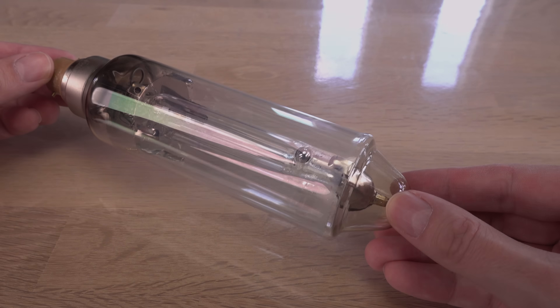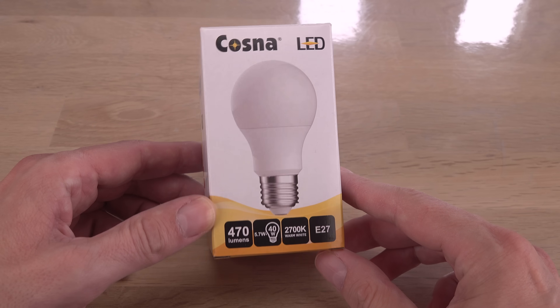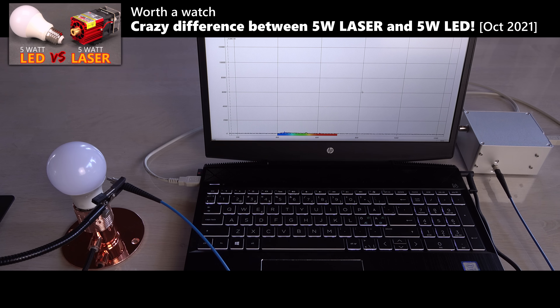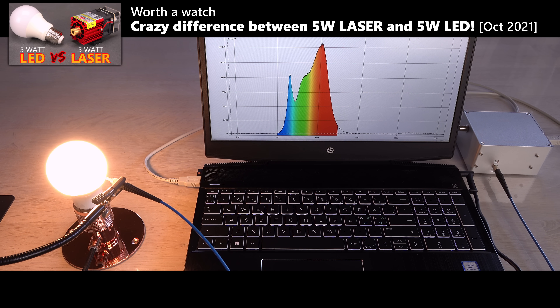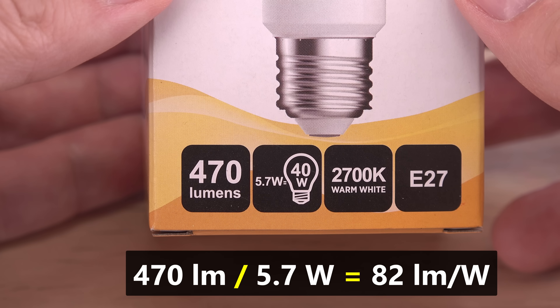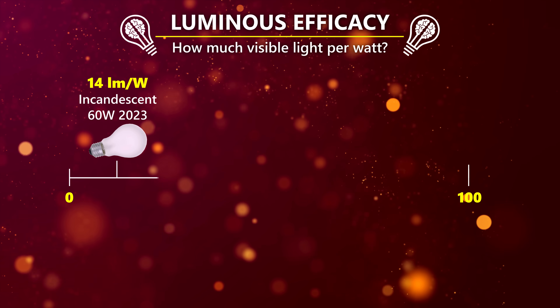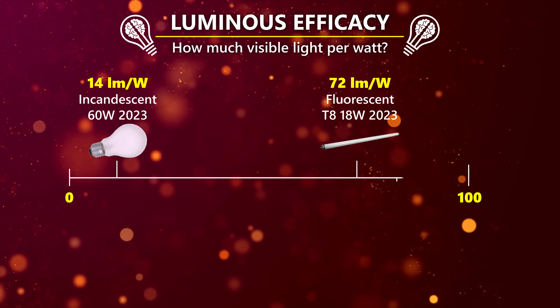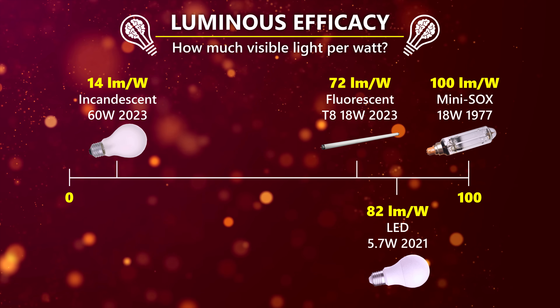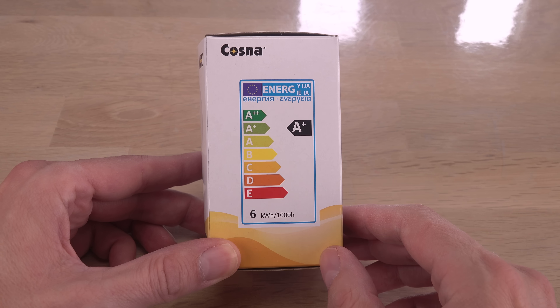How does this lamp compare to a modern LED? Not that long ago, in 2021, I bought this one for my laser versus LED video. With a CRI of 80+, most colors look decent when lit by this bulb — it is light years ahead of the sodium lamp in color rendition. But it only outputs around 82 lumens per watt. Despite being a much more modern technology, it is not quite on the mini-SOX level in efficiency. Yet its energy consumption was rated as A-plus back in 2021.